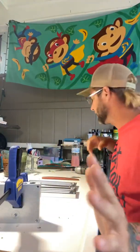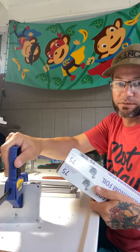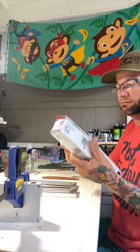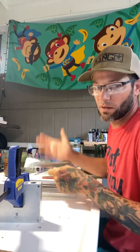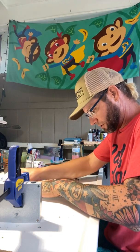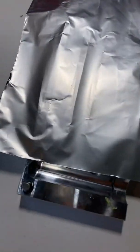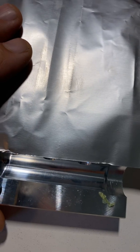I'm gonna try to do this without editing it. First, you need your mold. You need some clamps. Plastic's already heating up. You need some good, trusty store brand aluminum foil. What you're gonna want to do, cover one side of the mold with the foil just until the gate. You don't want to bring it out into the runner. So just like that.